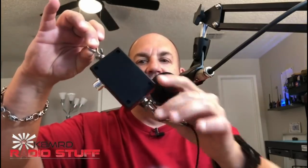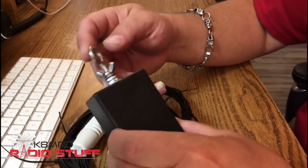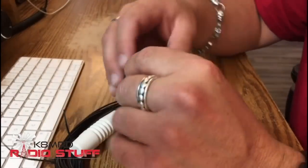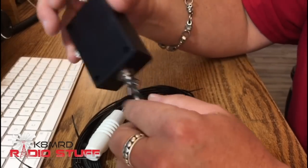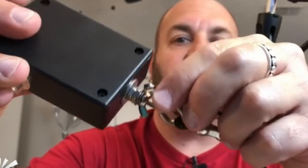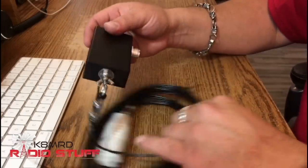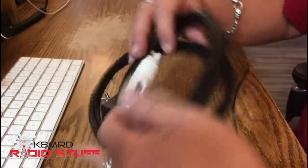Once you install this, hang it up, get it to whatever angle it's going to be at, and then drill a weep hole inside of it if you're going to kind of permanently mount this. Got a nice SO-239 here — the construction is absolutely fantastic. Here's where you can put a counterpoise if you need one; we shouldn't need a counterpoise because the coax is going to act as that. There are these little wire retention things, and really the only criticism I have is where the solder is on the ring terminal — I wish there was just a little bit of heat shrink on that to tidy it up. Not a big deal, it really shouldn't affect the antenna in any way, shape, or form. Then you've got a nice insulator on the other side with again that little retention thing.